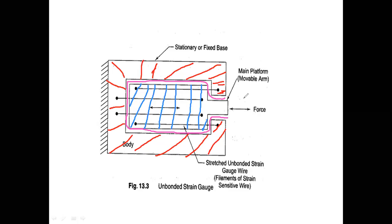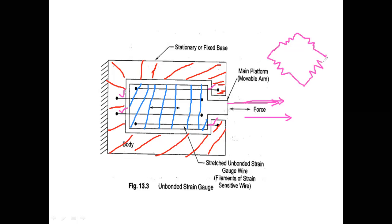So what will happen if I apply force like this? The frame which is shown in blue color will move towards the force. The force is in this direction, so this frame will move towards this force direction. So this wire and this wire will elongate, and this wire and this wire will compress. If I assume these as four wires of a Wheatstone bridge, or four resistors of a Wheatstone bridge,